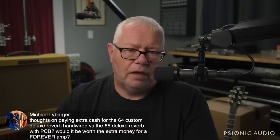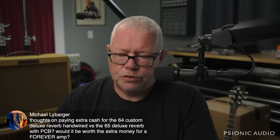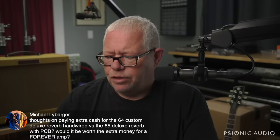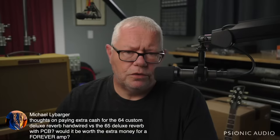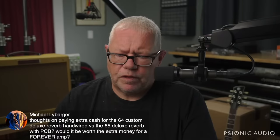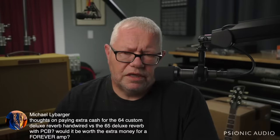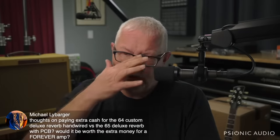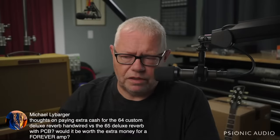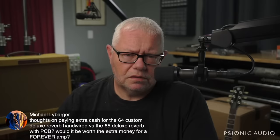And I would have a hard time paying the new price for a 65 reissue because there are so many used ones in very good condition out there. I think buying a used mint condition 65 reissue for $1,000, $1,100 maybe, and spending $100 to get the longevity stuff, which I've shown on the channel, is the way to go. It's just moving the hot stuff off the board, heaters and screens. A good tech can do that pretty easily in 2 hours. And then you have all that money to play with speaker choices.